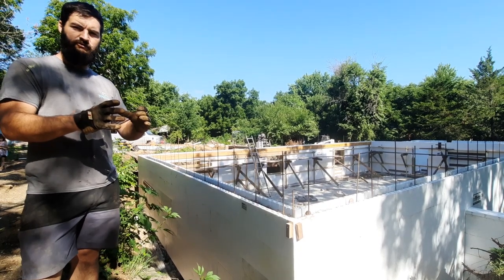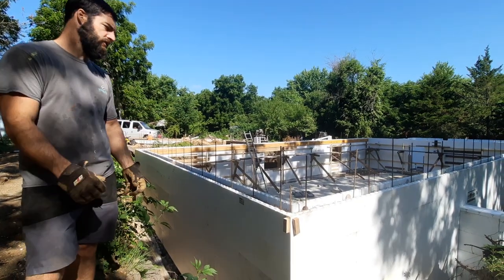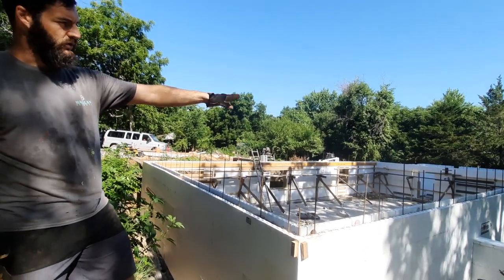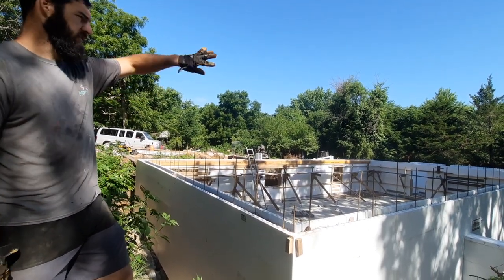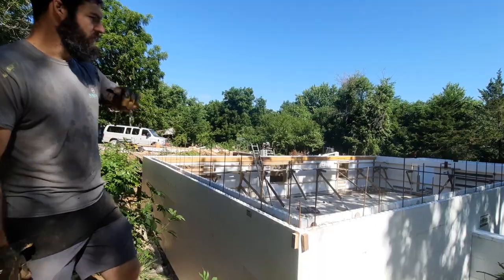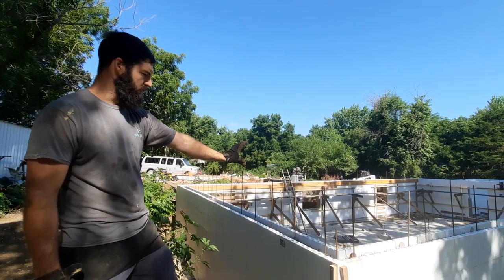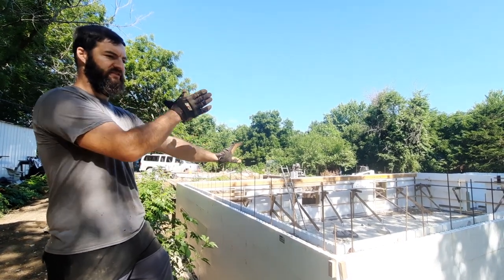I'll be going around the wall with a hose - there's going to be a pump truck - running a hose full of concrete down into the wall. Those are ledger boards. We wet-set our J-bolts into the concrete ahead of time, so that's all ready to go for a deck once we get to that point. We have those three spots on the outside and then ledger boards on the interior wall the full length of both of the long walls for our floor joists. This isn't a conventional basement where your floor framing would sit on top of the wall - since we're going up with concrete, your floor framing sits on the inside.